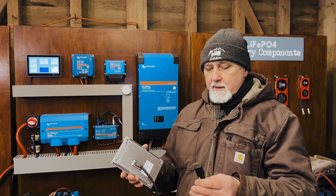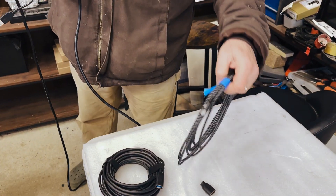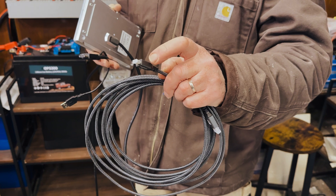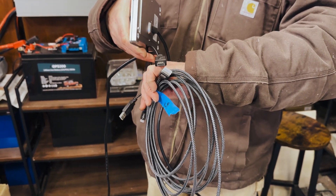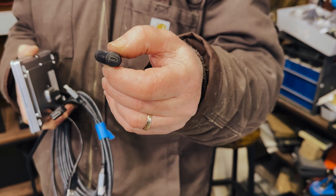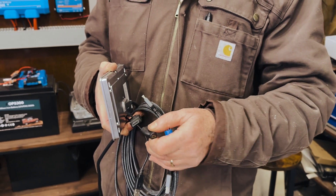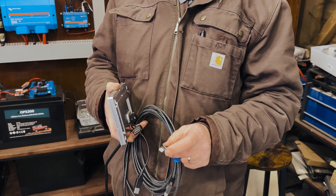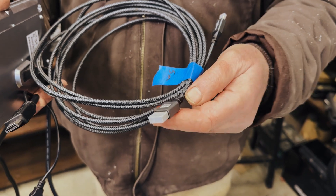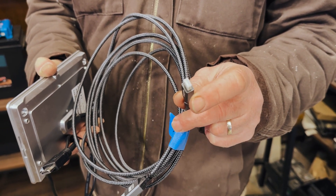So let's talk about extending this. We have done a video in the past about the HDMI — here's a 5-meter HDMI using micro HDMI to standard HDMI. This is what we plug into the Cerbo GX, and this end is where the screen is. You'll need an adapter: a female micro HDMI to female HDMI. We plug the screen into that, and this enables us to drill a much smaller hole — around 10 to 12 millimeters — versus about 20 millimeters for full HDMI. That's far easier to get through tight spaces.